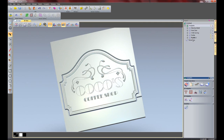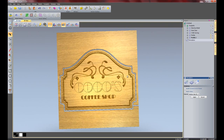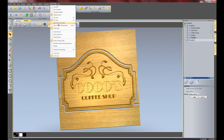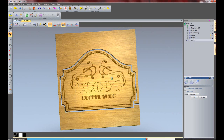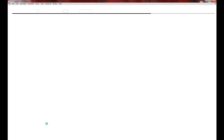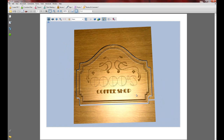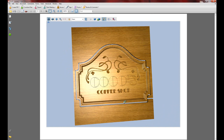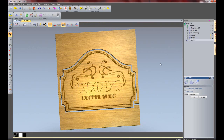There you can see the piece cut out. If I wish to change the colour of this, I just click on the simulation and change the colour to whatever material I like - let's say medium oak. I can export this as a 3-dimensional PDF, so let's call that number 1 and save it to my desktop. Here we can see the 3-dimensional PDF that has been exported. You can send this to one of your customers for approval before you machine it, and they don't need to have ArtCam installed - it can be opened with Adobe Acrobat.